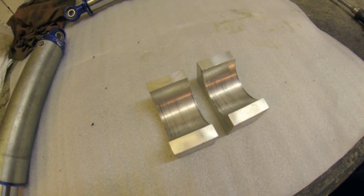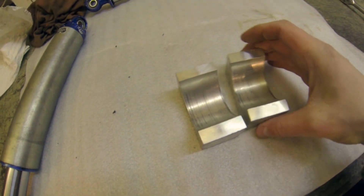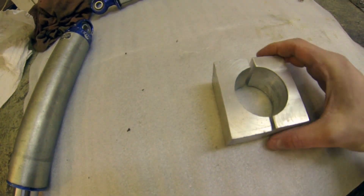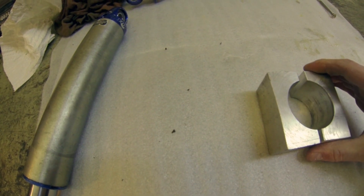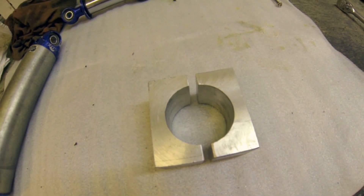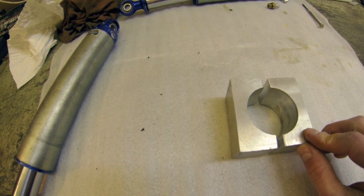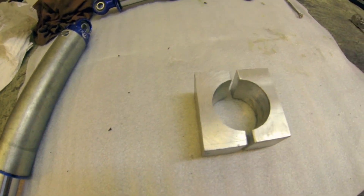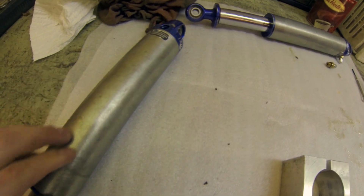In order to hold the shock in the vise, I went ahead and made this holder here. I've bored out the exact size for my shock and then cut it in half, so when I clamp down on it I'm not going to damage the body of the shock with the sharp teeth of the vise. The soft aluminum shouldn't mark my shock. If you don't have aluminum, you could make one out of wood — just bore out the center to the correct diameter and cut it in half.